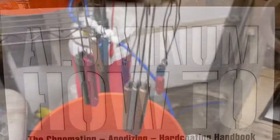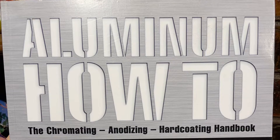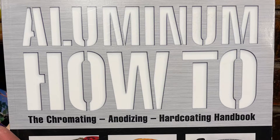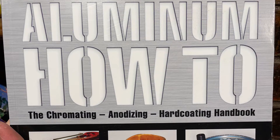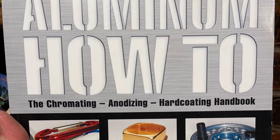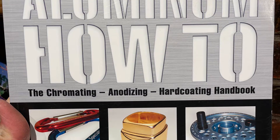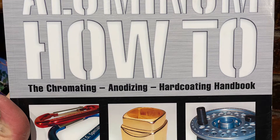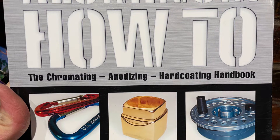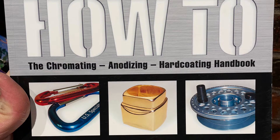After dyeing, they get a quick rinse and then go into nickel acetate, which is legitimately toxic. You do not want to get it on you — it does build up in your system. I tried to avoid using it for a long time and just did a hot seal, but from this book that I'm recommending very highly, it says you really can't get a real seal without using nickel acetate. So I made the switch and I'm glad I did.